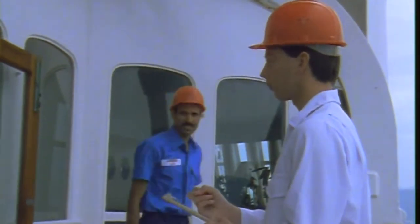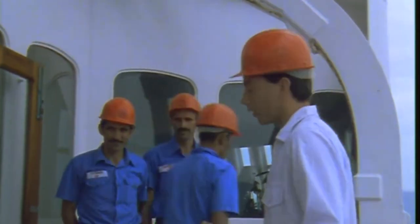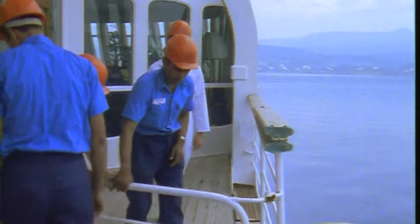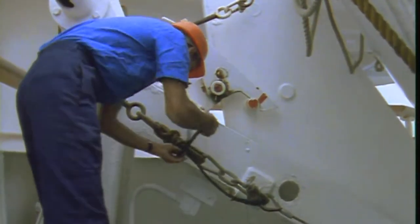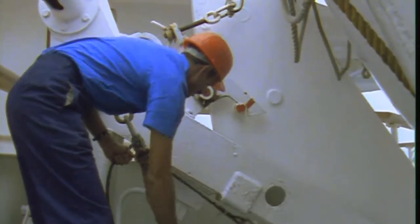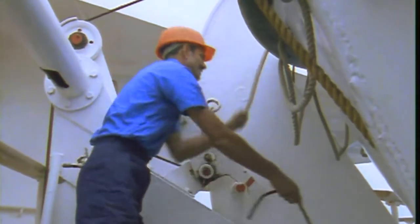At the embarkation deck level, the handrails are cleared and the embarkation ladder lowered. Open the gate. Clear away the gripes. Once the crew members have left the lifeboat, the gripes that secure it to the davits are released and cleared. Depending on national regulations and the design of the ship, it may be necessary for two crew members to stay in the lifeboat as it descends to the embarkation deck.